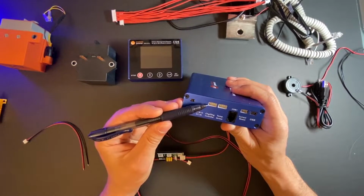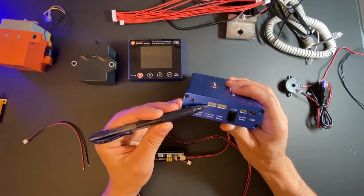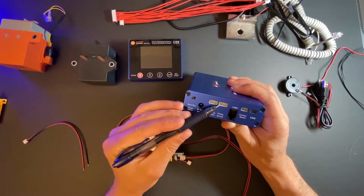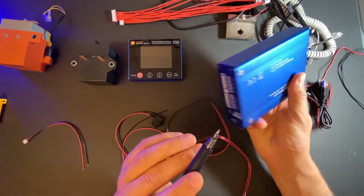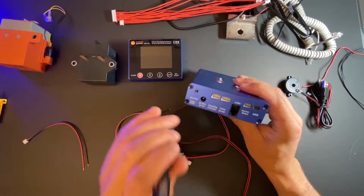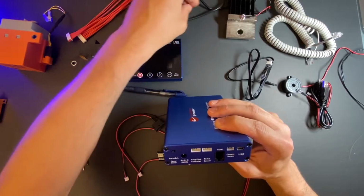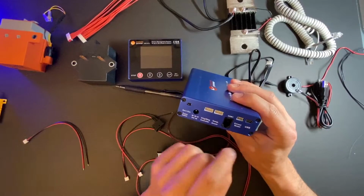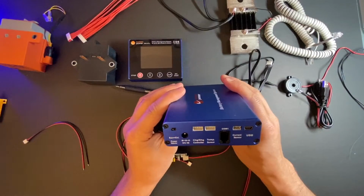Next is the charge and discharge controller. This is what is controlling our relays to turn them on or off. Next one is the temperature sensors. COM1, I don't know what this is for, because on the other side we have COM2 where the LCD module connects. Then we have the current sensor, so this wire from the shunt is going to go to current. Also a mini USB for updating firmware, and this module right now is running version 4.0.